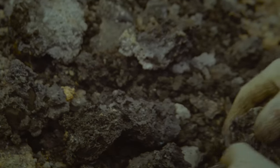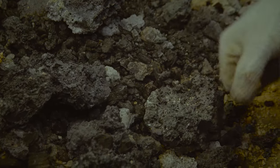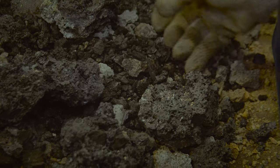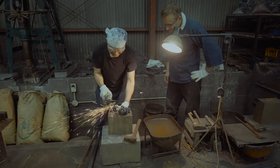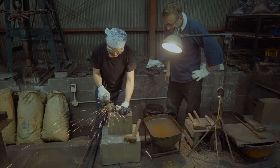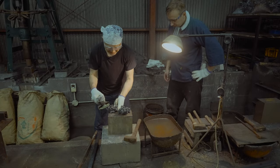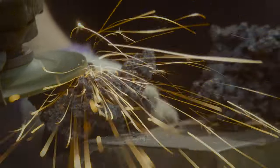Yeah. So right now I try to crush it all and then collect the iron by magnet. And then use the Oroshigane technique and put it together. So before doing that, especially this one, I check the carbon percentage by spark. Yeah, it's a cast iron. Very smart thought.